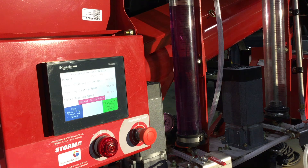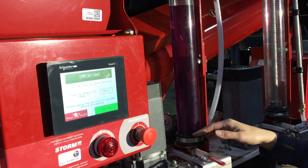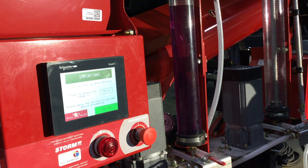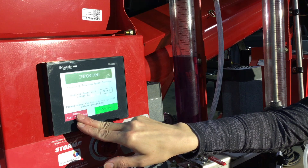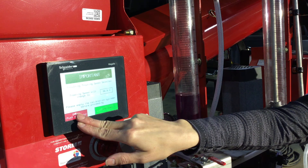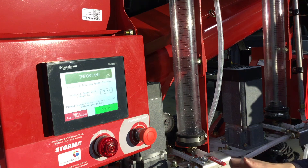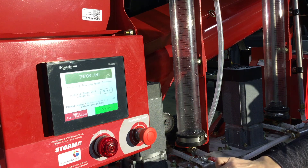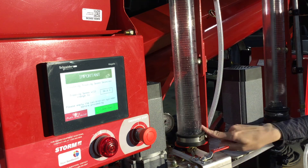From here, I would utilize the resulted treating speed — it gives the option of moving your treating speed up just a little bit. From here, the screen is going to prompt you to empty your calibration cylinder. This is to ensure that you have no wastage of treatment stuck in your calibration cylinder during the treating process. You want to ensure that it is completely out of the lines and back into the treating process that will go down to the boot. Also, you want to make sure that you have closed your valve to the treat position so that your treatment won't go back up into the calibration cylinder.